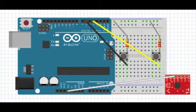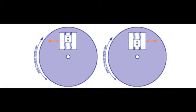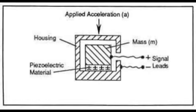This simply provides a 3.3 volt current to the sensor. The sensor then takes this voltage and splits it among 2 parts, the gyroscope and the accelerometer. The gyroscope works by a tiny piece of mass inside of it which slides around and sends a specific serial data depending on the movement, while the accelerometer works by tiny crystals which are stressed and therefore allow a specific amount of current through depending on the amount of stress, and they send another specific serial data entry with these